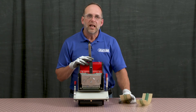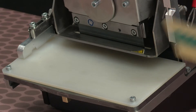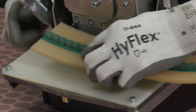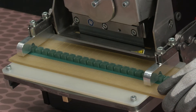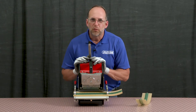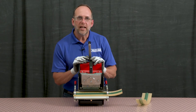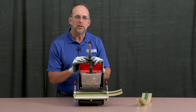Load the belt from the left side with the notch V-guide up, clamping the last V-guide notch first, and then clamp the second clamp securing the belt in place. Since the table is in the forward position, turn the crank handle counterclockwise, rotating the handle until the belt is fully punched.